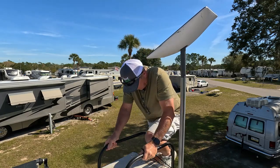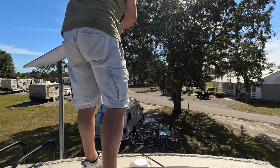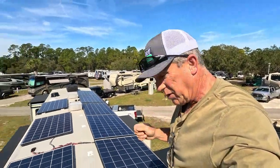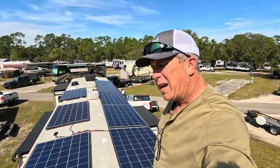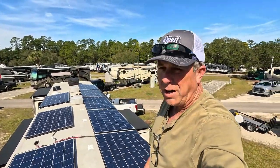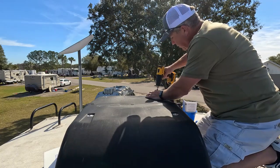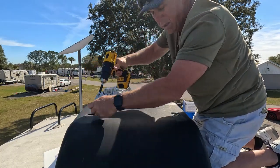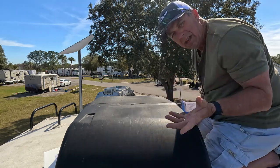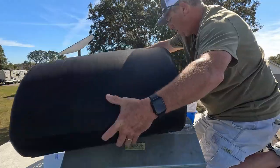We've got our Dishy here, which makes it kind of interesting climbing up on the roof, but I always keep two hands and you should be in good shape. We've got our tools up here. We're going to be working on the rear air conditioner, so we're in a good spot. We've got all of our solar panels up here. Surprisingly enough for it to be February 1st, there sure is a lot of pollen here in Florida. On the Coleman Mach, there are four Phillips head screws right here on top — I'll spin those off right quick, and then it should just lift right off.